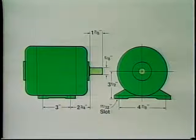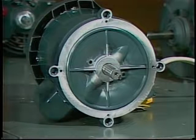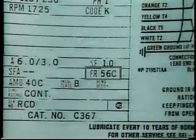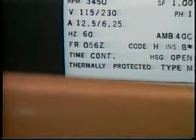The dimensions of the motor otherwise — its length and diameter — are not specified. Many small motors of all kinds, single-phase, three-phase, and DC, are 56 frames, most of them one horsepower or under. Bigger motors have higher NEMA frame numbers. The letters following the basic frame size provide further information. T refers to the new NEMA standard adopted in 1964; the older standard has a U after the frame number. C means the motor is suitable for mounting directly to a component by bolting to its face, and may or may not have a foot mounting bracket as well. C-face motors are very common in many frame sizes. Z means the shaft is non-standard in some way — in this case it means a double-ended shaft. Your study guide contains a list explaining what other letters mean.